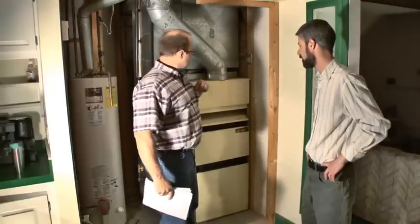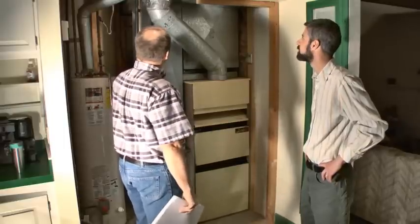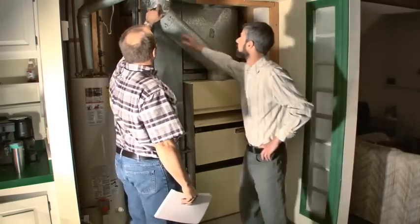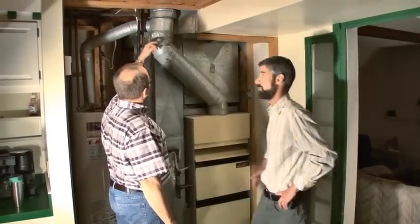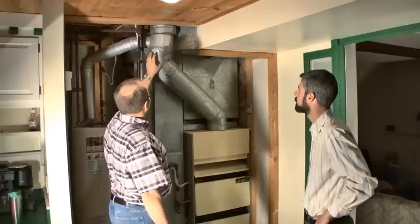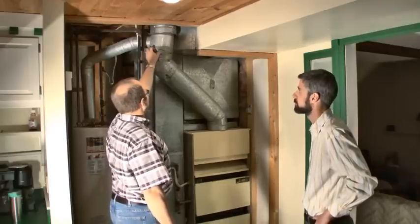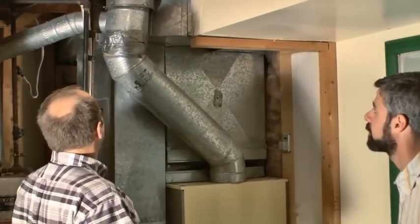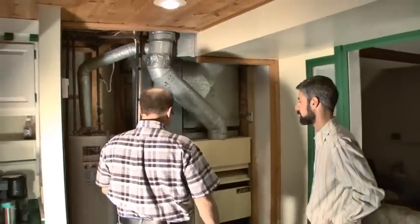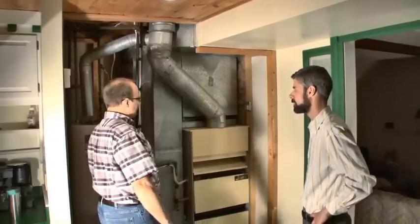When I come into one of these rooms, I take a look at the appliances and look for problems. For example, this is duct tape here — not good for duct work, despite the name. For one, it's a combustible. This is the flue pipe, and it has to be six inches from any combustible. So this actually could start a fire — it's not appropriate. We need to get that fixed. I always look at combustion air first, and then I generally look around for obvious problems before starting all my diagnostic work.